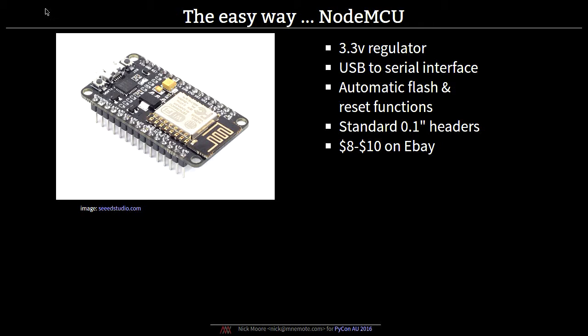It's a very handy little piece of hardware. Originally it was kind of marketed as a way to run Lua, as Damien mentioned, but there's nothing actually locking that particular module onto that particular language. It's really just an ESP8266. The one time that module gets annoying is if you actually want to use the UART for yourself, because it's kind of tied up directly to the USB port.